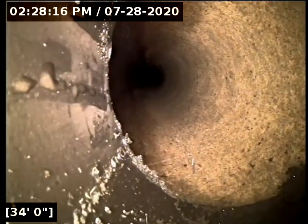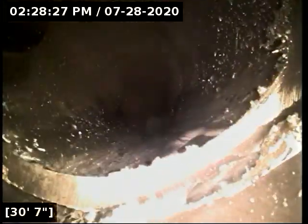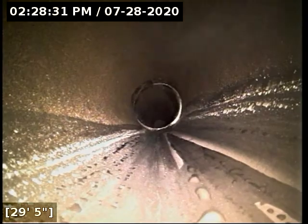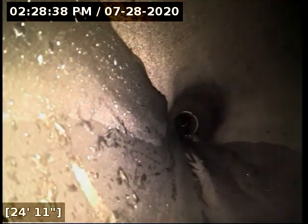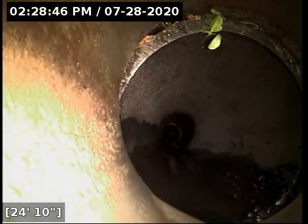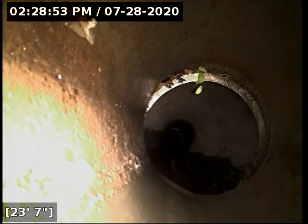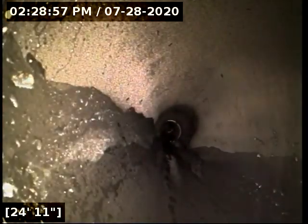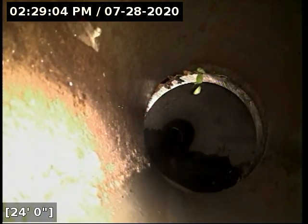The concrete pipe still looks good, drains very nicely, super clean. I think this is some of our newer pipe here — it just doesn't have much of a water line or mildew film on it. The joint looks sealed off and tight, as does that one. At this joint there's a little bit of green stuff at the pipe joint — that's just a little leaf off a weed or something that went down the cleanout. It looks like that joint shifted just a little bit, but nothing concerning or in need of repair work. It shifted by maybe a sixteenth of an inch, but there's no standing water. This was probably just put together this way to coincide with the current grade, affixed that way to provide slope to the sewer line. That joint is very, very sealed off to the ground.